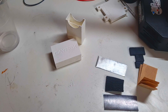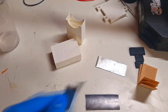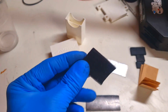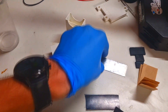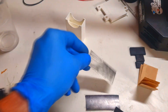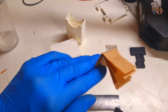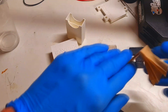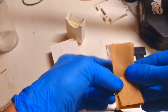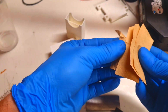Here I have everything I need. The positive current collector is some graphite, and on this graphite I will put some graphite felt. The negative electrode is simply some zinc. The separator — the salt bridge — will be made from filter paper, several filter papers.